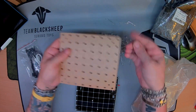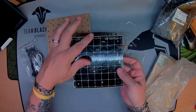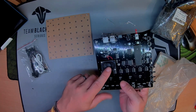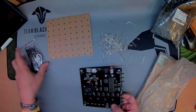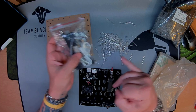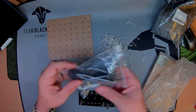Basically you have to jig up 64 and solder them in a grid and then repeat that 8 times and then solder those onto this. Stick it in the acrylic case that's here. And it gives you an audio output — I think this is a 3-watt speaker, an MP3 player off the micro SD card. You run it off a USB to barrel jack, so any phone charger will be fine. Remote control. You can run a 3.5mm jack through it. It's got plenty of different programs on it. You can program it with a built-in or included FTDI adapter.